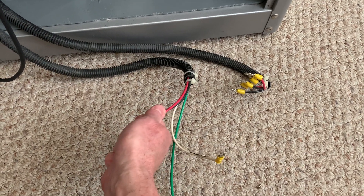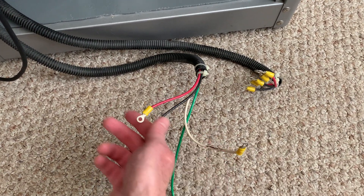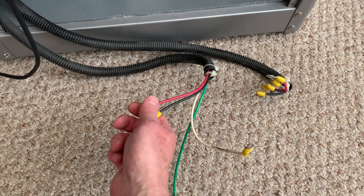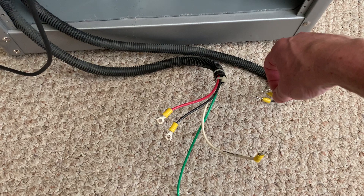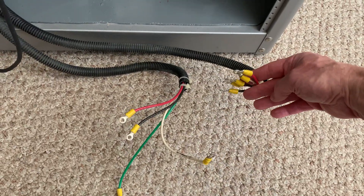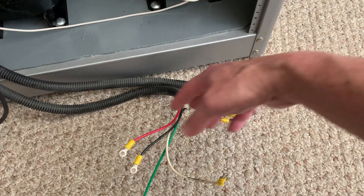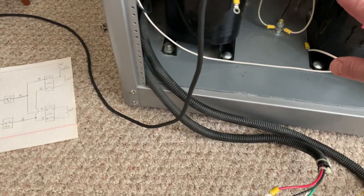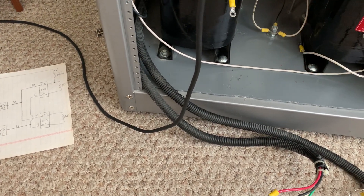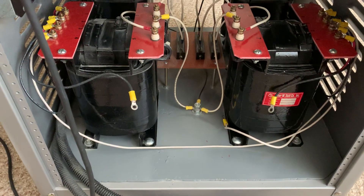When I recently switched this thing over, I've basically made the red and the black just the black, and now you're going from the black to the neutral, which is 110/120. I'm seeing voltage on both sides of the relay contacts — the electronic relay contacts — even when the relay is not engaging. The whole thing is messed up. I traced everything down; this goes back to the power strip in back that powers up everything else. The way I designed it years ago, the transformers saw two open relays normally until I hit push-to-talk. When you switch to 110 it doesn't work like that anymore.